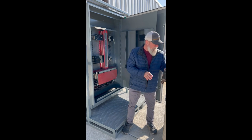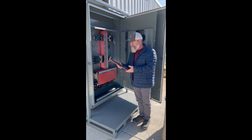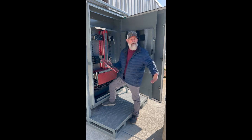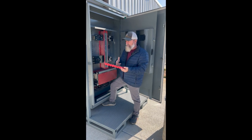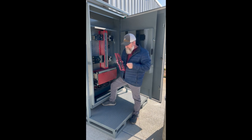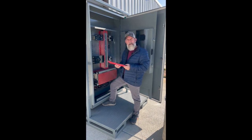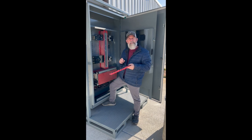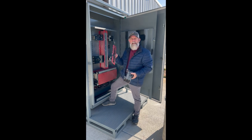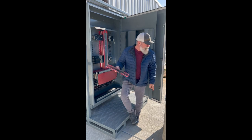This back piece was not maintained, was not clean. Some may disagree and say it took a shot because of breaker overload — that could be true — but it was never cleaned and it actually ran for a while in this condition. This is the back piece insulator that goes against the frame. If you look real close where all this tracking and flashing occurred, you can see it starting to fray down — it's getting really brittle. This is not something you want to run in your panel. We have piles of this stuff and we also repair panels, so reach out if needed.